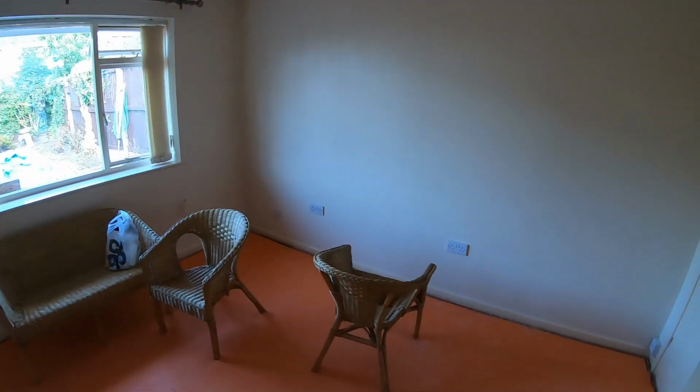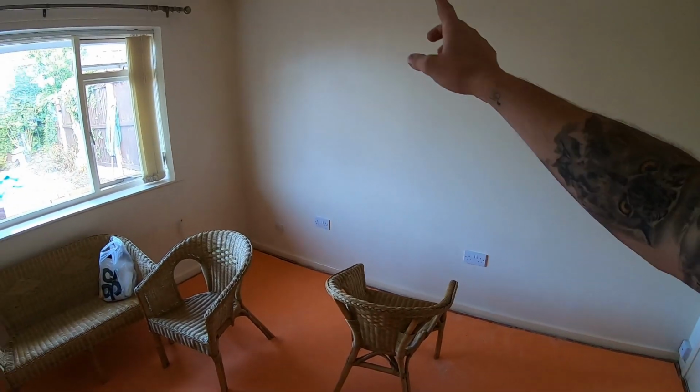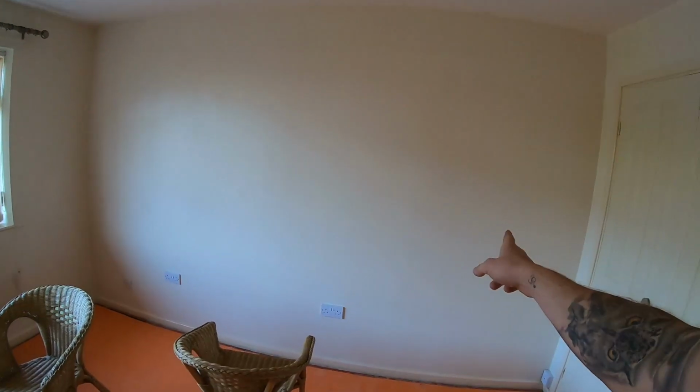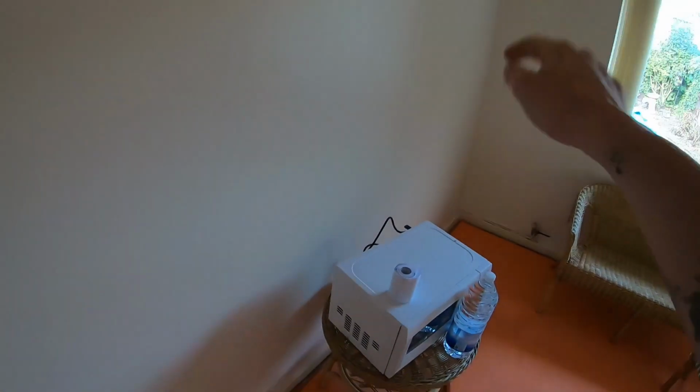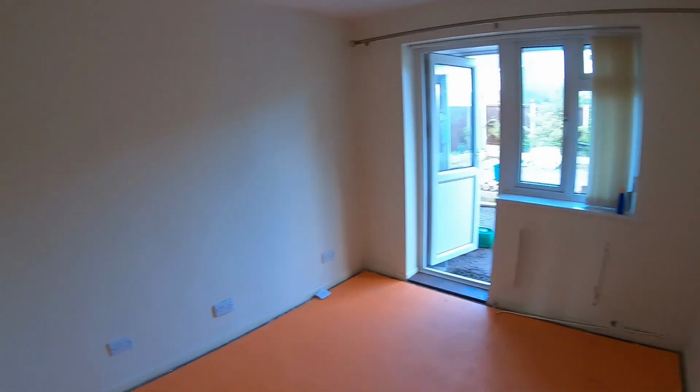Bedrooms. They're being pushed out a little bit for a 4'6" bed. We're going to put an intermediate switch in, so either side of the bed, off the one here for the centre light. Double socket, that one's being shifted to go across a bit. We're having a TV socket and an aerial point on here. In the wardrobe, I'm going to do some LED strips off a sensor, so once they're open, obviously, a bit of light. Similar sort of thing in this bedroom.